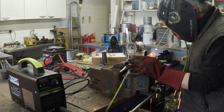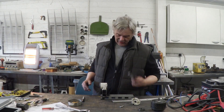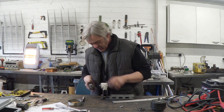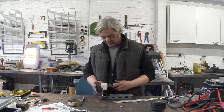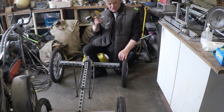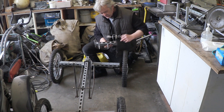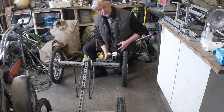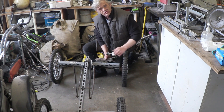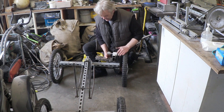Let's weld that on there. I've welded that on at an angle, and clearly that bit goes in there, this bit goes on here, back on with the bearing, and then on with the coupling. Our transmission goes right here where we drilled four bolt holes. The more observant will have noticed there are some bolts welded in here — that's so when I fasten it down and put the chain on, the chain will have a little slack, but these bolts act as a chain tensioner. It also allows me to swivel it back and forwards to get everything in line.